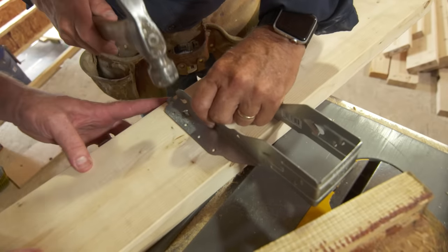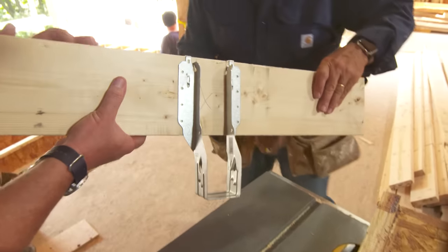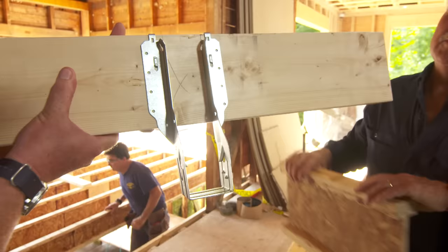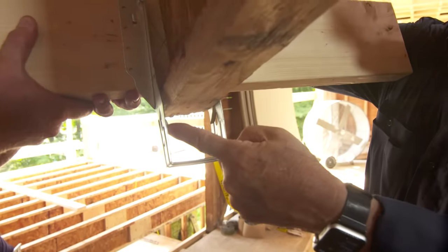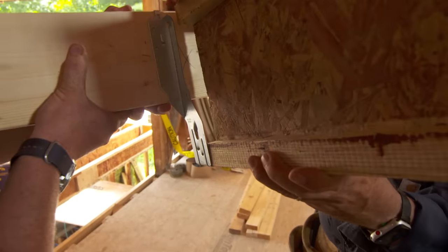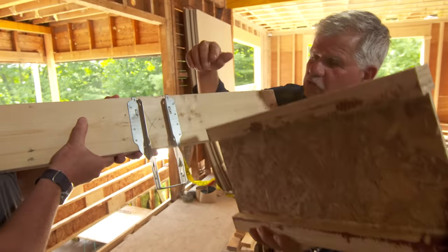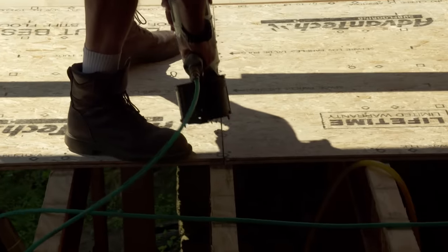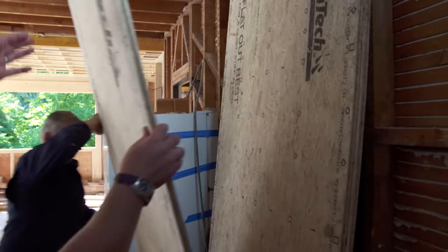These little pieces of steel that stick out — you tack it down, eyeball it on this side, and tack this down too. Once those two little tabs are in, that holds the hanger in position. Then you drive hanger nails or hanger screws in place. Once fastened to the beam, take your I-joist and drop it into the hanger. These little clips on each side — bang them down hard with a hammer so they snap into place. Those clips stop the floor joist from coming up and lessen the squeaking.